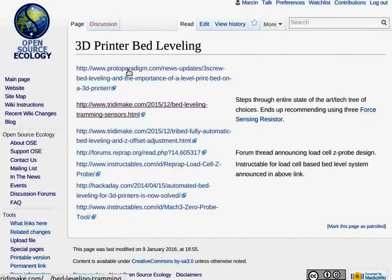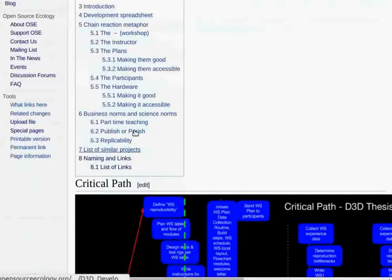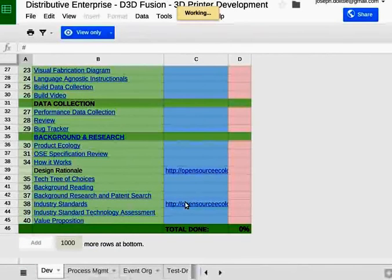You need to locate it somewhere near the printhead in a smart way so that it gets squeezed. So it actually gets squeezed and it gives you a different threshold current through it, or resistance through it? Yeah, it changes resistance when you squeeze it. So that's like a piezoelectric? I don't know if it's piezo, but I would guess something like that. Okay. So a pressure resistor.